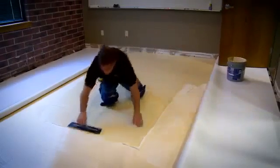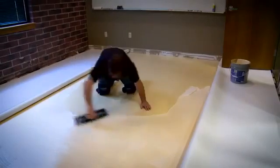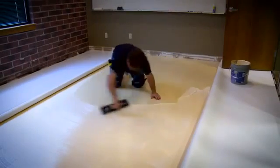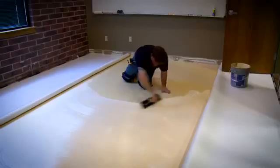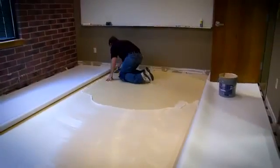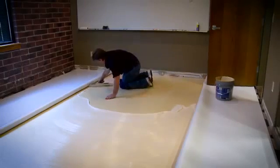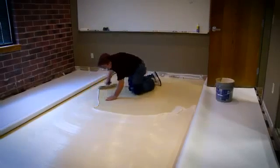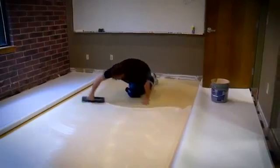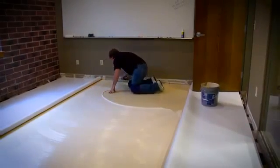If the notches are too large, they place too much adhesive, which can lead to trowel marks showing through the material. It can also leave excessive indentations. The trowel marks and indentations can cause swelling and buckling throughout the material. If the trowel notches are too small, the adhesive will not hold the flooring down. With the proper trowel, spread the adhesive over 100% of the exposed subfloor.